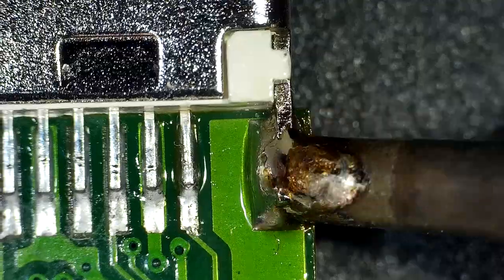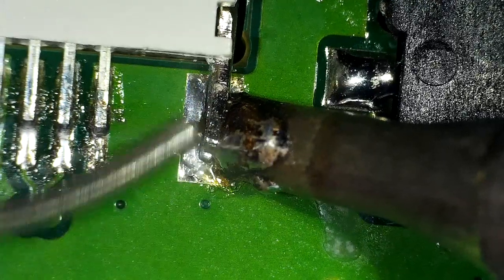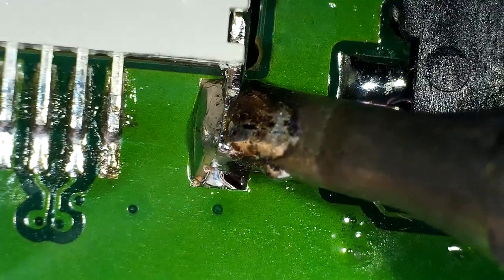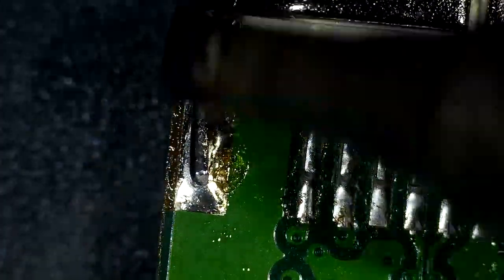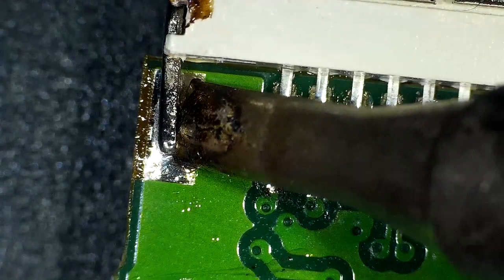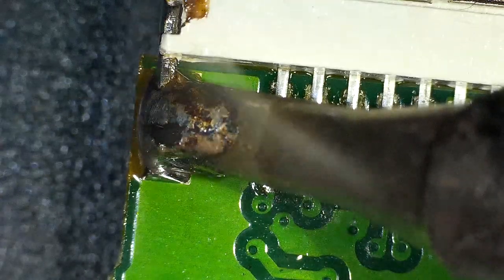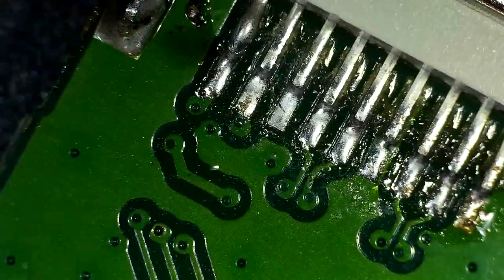Solder that end — probably a bit too long there, but that's okay. Let's flip it over and do the other side as well. Same strategy. I didn't put any flux down this time, so as you can see I'm having a bit of difficulty. The old solder is taking a little bit longer to melt and kind of floating around — definitely not a good idea. Don't skip on the flux. I guess I was lazy. Don't be lazy. It does eventually heat up and gets there. I managed to heat up one of the joints and leave a bit of a solder gunky thing — that's fine, we'll fix that. Let's inspect the joints. Are they the best joints? No. But they are better joints than before.